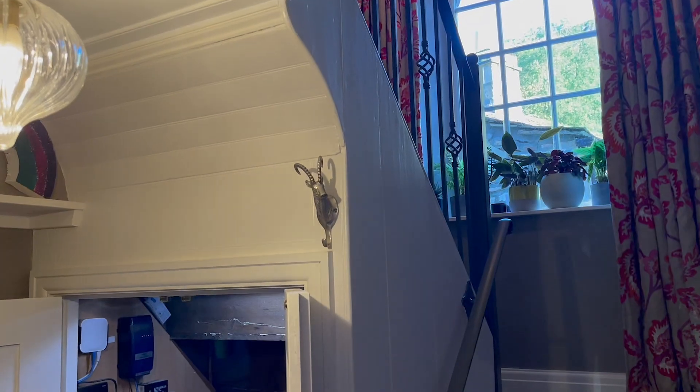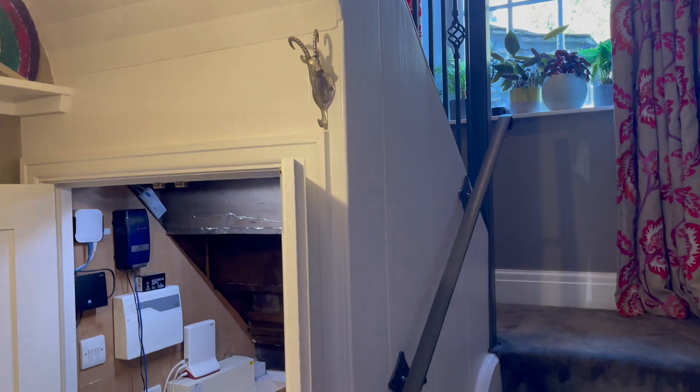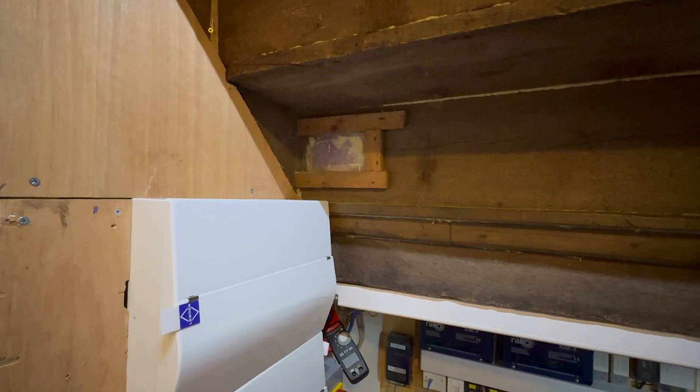While in its own right that isn't enough to force a change, let's look at the risk. This old board is installed under the main escape route from the upstairs of the property. The staircase is constructed from exposed wood and doesn't offer any form of fire barrier. If a fire starts from an electrical fault in the consumer unit, that could be a major problem.